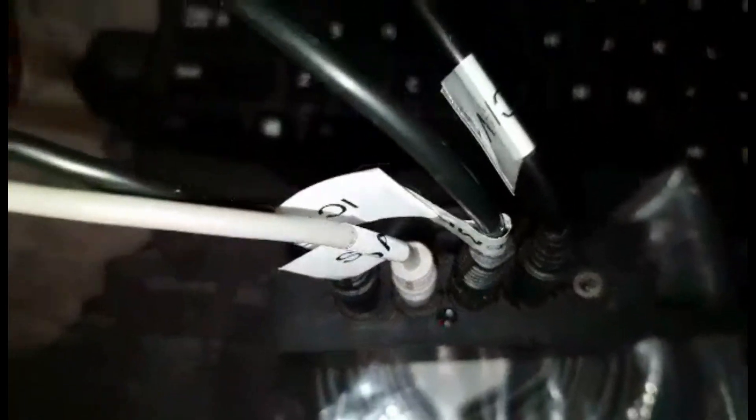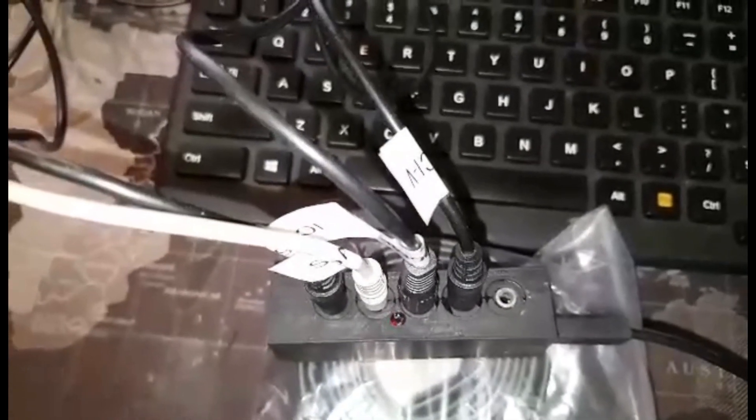When it does start communicating over the serial port, the light will go on solid. So what we'll do is try to set this up so you can take a look. On the PC over there, we're going to start up our HRD. I know that this unit is COM32, so I'm going to communicate with COM32, and with my 7300 through Bluetooth.